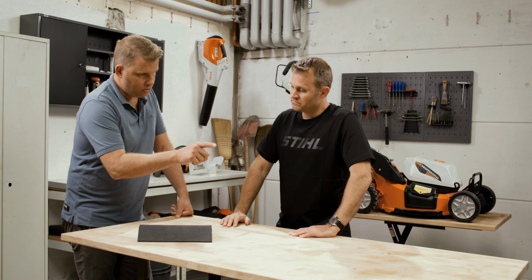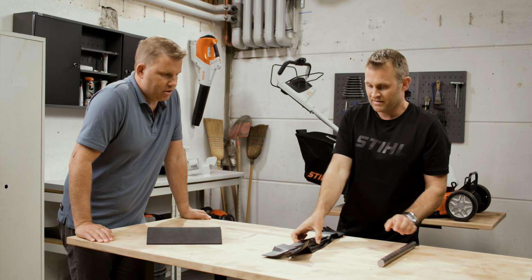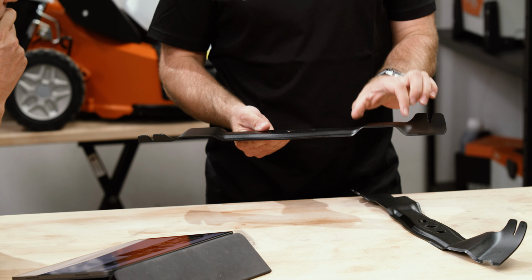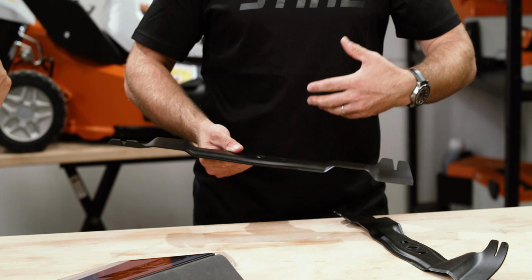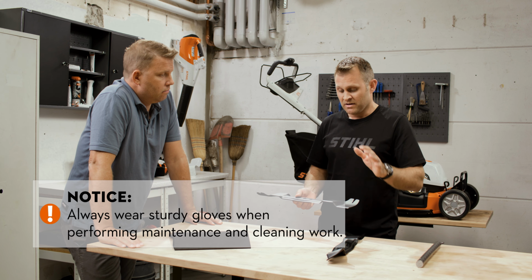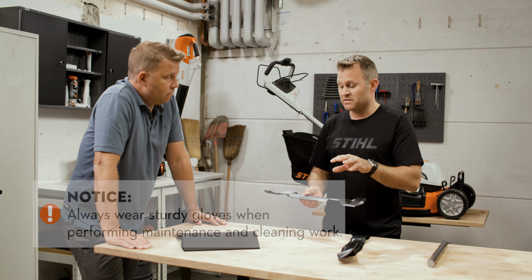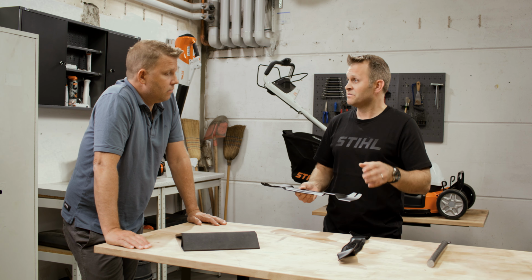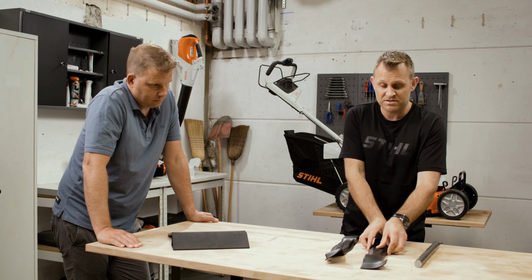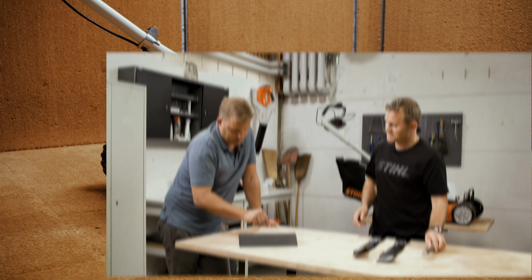And then the final test, you wanted to show me about the blade. When you stood it up earlier, we saw the blade at the bottom, and there's a particularly interesting piece of technology here, right? Yeah, so this blade actually has a predefined bending zone in the blade. So as you're mowing, if you come across a tree stump or a rock or something that you can't see because the grass is too high, you don't want any damage occurring to the motor of the machine. It's best that the blade bends because it's cheap and easy to change a blade rather than changing the motor. So you've got a predefined bending zone here, and in the test we'll see in a moment, you'll see a rod come up from the ground into the blade, and let's take a little look and see what happens. Okay.